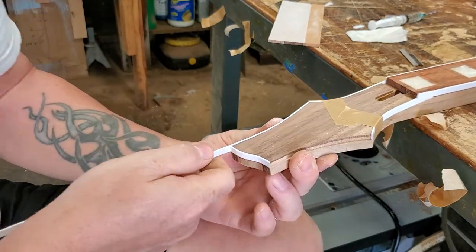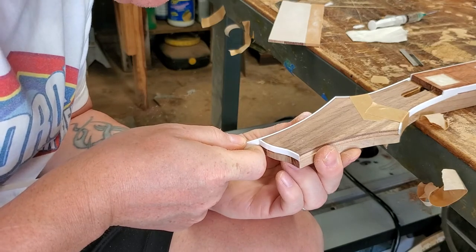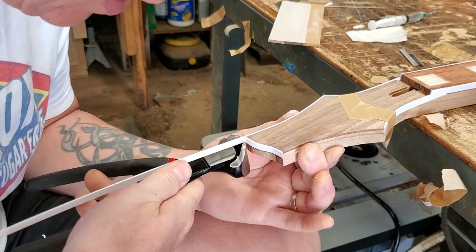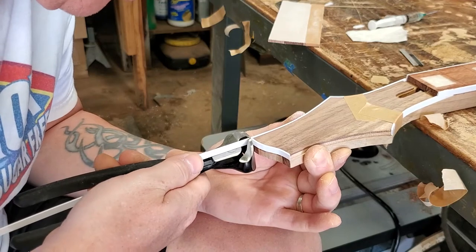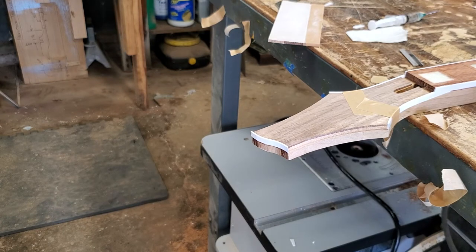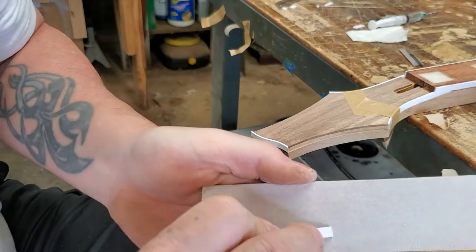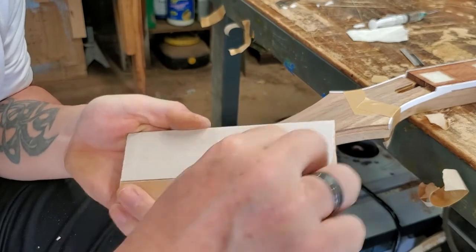All right. So what I do then is push this baby up there and I give myself a little extra. I make sure there's a bit of daylight there, a bit of a gap that I see, which is the binding pushing it out. And then I take my nippers and I come up flush. And I'm cutting it with nippers, but you could use whatever you got. I highly recommend these. I think these have made this job go much smoother. Oops. Just take and sand my angle.